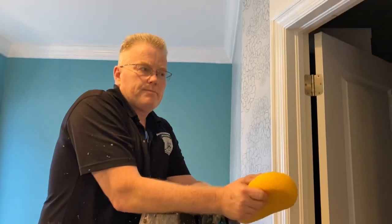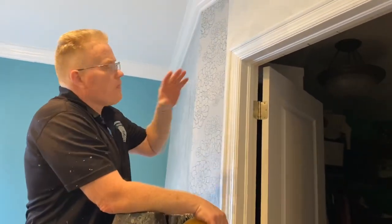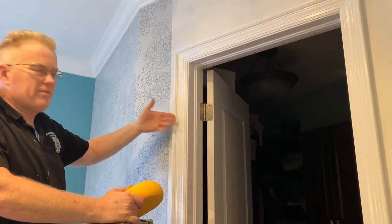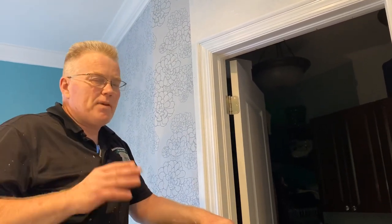One of the ways to save wallpaper, and sometimes a lot of wallpaper, is when you're wallpapering around doorways, windows. Now, the layout of this job necessitated that I violate one of my rules and I come within 3 inches of an obstacle. It happens. Sometimes you cannot get a seam far enough away. Ideally, you want it 4 to 6 inches away from an obstacle. You want a good piece of meat to hang on these things,